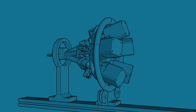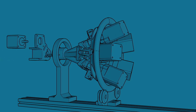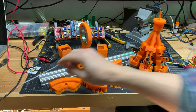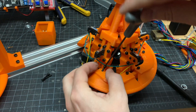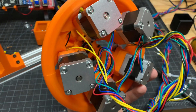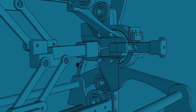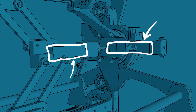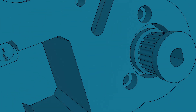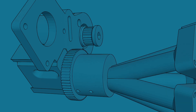We'll turn the whole thing with a stepper motor mounted up front where the lock is. We're also going to need a way to determine when the lock has been picked. In version one I used load cells, but this time I'm going to use an optical encoder. This will let us detect how far we're actually rotating the assembly and infer if the lock has been picked or not.